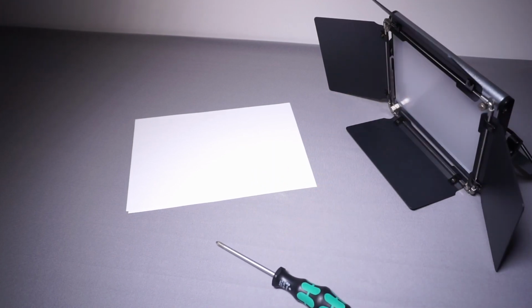So if you remove that diffusion panel, you do get slightly more light output, which could be good in certain settings if you need more output in a pinch. But just be aware that shadows can look a little bit weird. In fact, I'm just spotting it off camera here, so I'm going to be very unprofessional and just pan the camera while I'm filming. You can see over on the wall there, you can see banding, you can see lines. Now, to your eye right now, that might just look like a color banding issue because of the bit depth of the video, but it's not. That's what I'm seeing in real life, where you see those different lines on the wall, and that's just a shadow of the light itself. Those lines are caused by all those different LEDs casting shadows slightly differently. So that's just something to bear in mind, that's what will happen if you take out the diffusion panel.